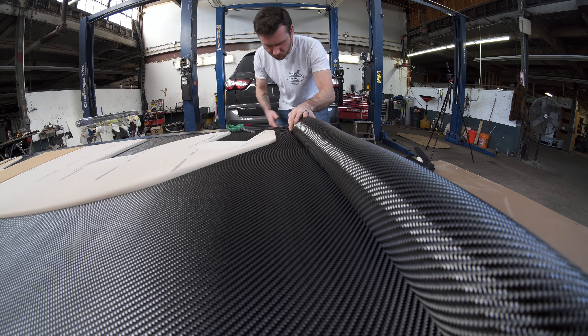Just for speed, I marked the 4 to 1 ratio on the cup. It's really important — always have enough resin. I'm glad I ran this as long as I did because you can see where all the resin is going to end up. It'll actually pull it hopefully pretty evenly, because you don't want the center to arrive and start sucking out resin right away — you're going to lose a lot of resin and keep dumping in there until the rest comes around.